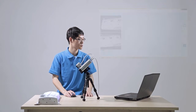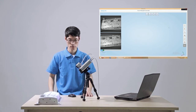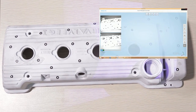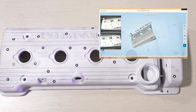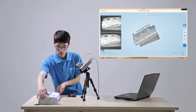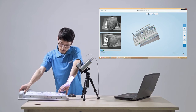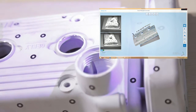Click the Start button to scan. In free scan mode, you can use mark point align or feature align. Paste mark points if some area has no obvious features. You can move the scanner or object to continue scanning; make sure the two scans have one third common overlap.